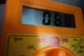For the house mains, this is 220 volt. We are keeping this on the AC range — that is 1000 volt. I am inserting the terminals now. We can see the deflection — this is fluctuating. You can see this is 256 volt right now. This is the method of how we can measure the voltage.